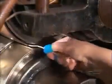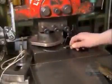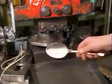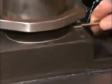Spoon blanks, meanwhile, go into a machine called the cross roller. It expands the spoon head sideways, thinning out the metal at the same time. Then it's into a clipping tool, which trims the spoon head to precisely the right size and shape. Both spoon and fork blanks now go into a machine that grinds their rough edges smooth by vibrating them against small plastic cones.